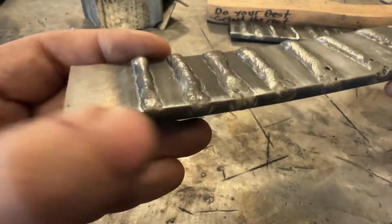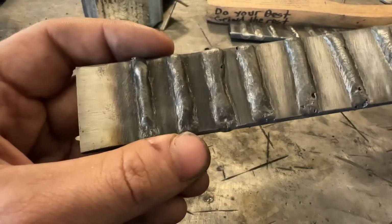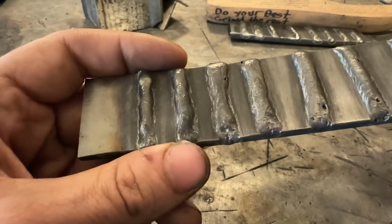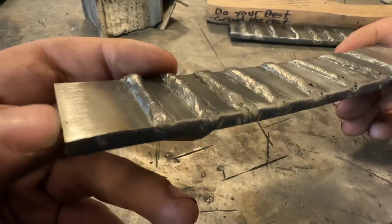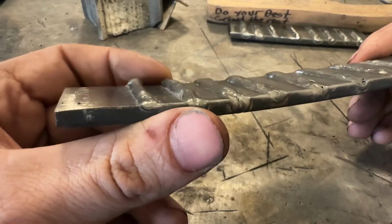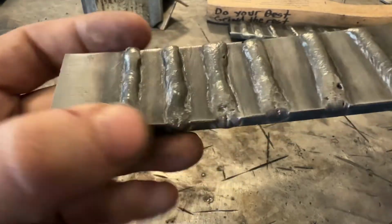Now, based on what I'm seeing, the amount of metal here might actually be enough metal for 1/4 inch plate for a single pass weld, or at least a decent solid weld bead size. So I think we should leave the wire feed alone, increase the heat input 20 to 25%. So in the case of wire feed, up 2 volts. In the case of stick, 15 amps, roughly. All right, let's move on to the next one.